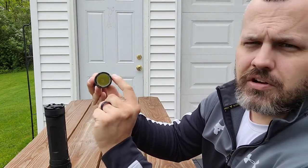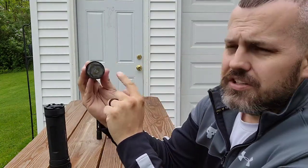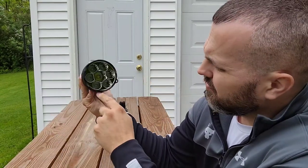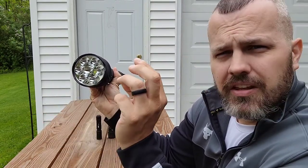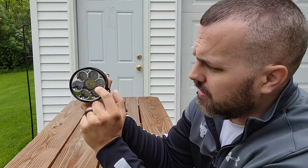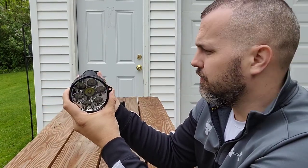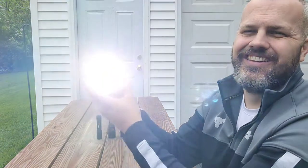Pretty much all these lights have a single LED. This one's reflector is what they call orange-peeled, to break up the light and make it more of a flood style. Spotlights have super shiny, polished reflectors. On the Destroyer Gen 2, even though it's polished, these reflectors swirl the light — the outside ones produce flood light and the middle one focuses the beam, giving you the extra-long 1,400-meter distance at 9,500 lumens.